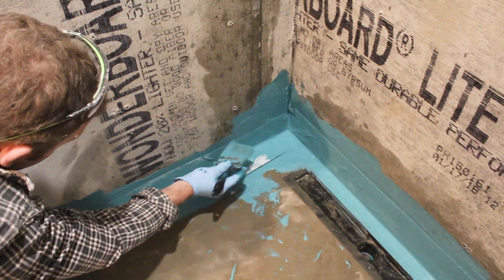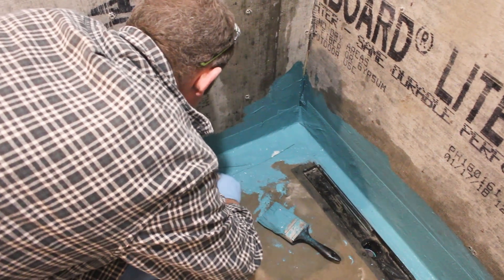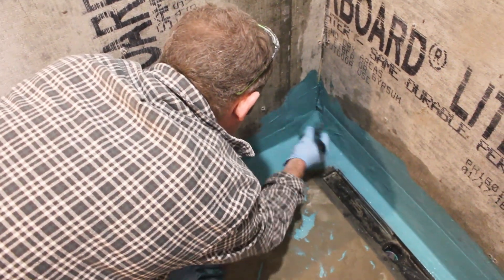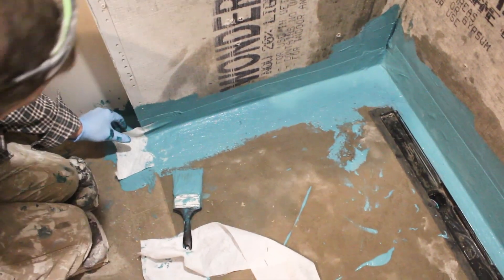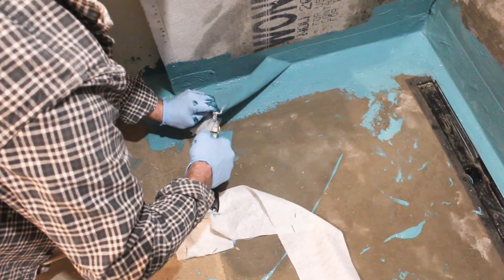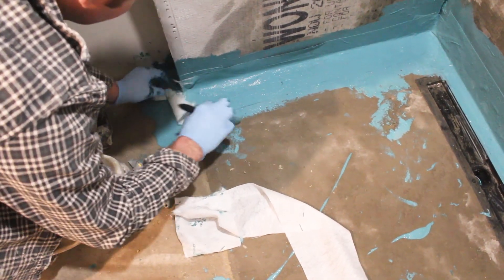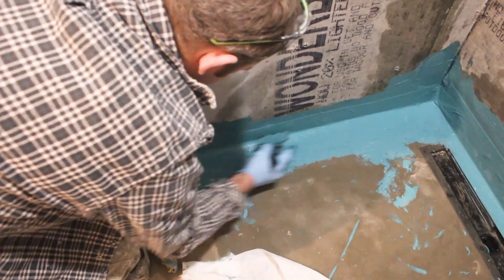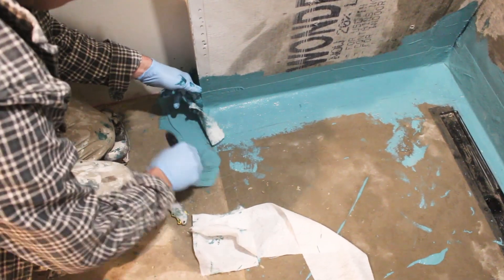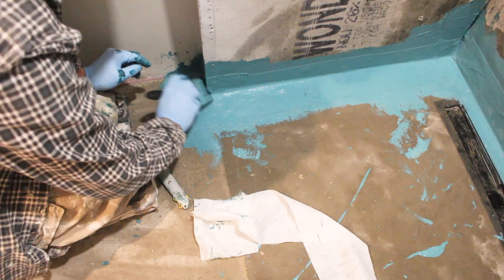As you can see, we continue to smooth out the liquid waterproofing going over the fleece. What's important is to smooth out any wrinkles in the fleece because wrinkles could adversely affect your tiling. Here we're making a slice in the fleece — sometimes it pulls the fleece from the wall, but don't get frustrated by that; just continue to move forward. The reason we cut that slit is so the fleece can roll over the additional waterproofing placed in the corner. That extra waterproofing in the corner is definitely a good thing.